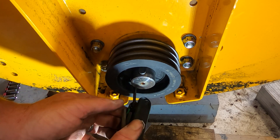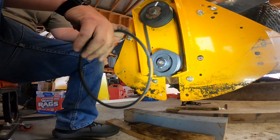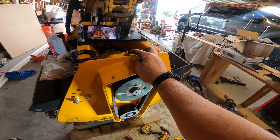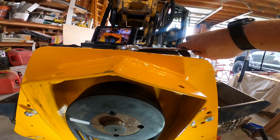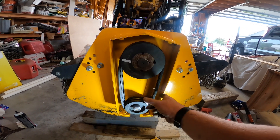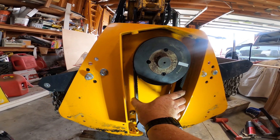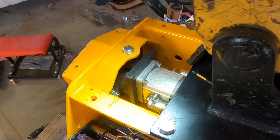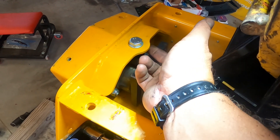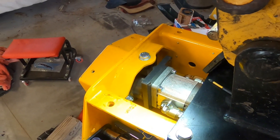Now that the pulley's on, we're going to put the V-belts on. Just like we took them off, just roll them on and roll them all the way to the back, and make sure you get all three of them on. Once they're all on, we'll tighten them up. Get that set screw on the top of the hydraulic motor housing, start turning it, and you'll see the motor housing and that top pulley start going up. What you're looking for is about a quarter inch to a half inch of slack when you pull on the belts. Once both sides of the motor housing are tightened, come back and run the 22-millimeter jam nut all the way up and give it a good turn with the wrench to lock it.